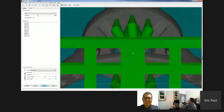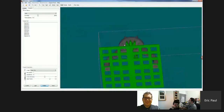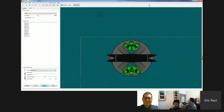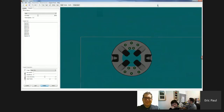So that's where those supports are lined up. As it gets a little bit too far, and then all the way out here to the edge. And that's why those supports were placed there. And the X-ray vision is good for looking at this as well. I always run through with X-ray vision and just slowly go through looking to see what that slice is going to look like.